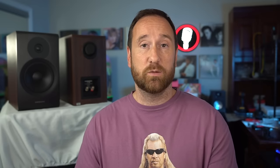I ran another impedance sweep on the woofer with the CLD applied. It didn't resolve the resonance, which means something else is going on — and I'm not going to destroy the woofer to find out exactly what. But I'm not making a mountain out of a molehill when I say that the resonance from the woofer imparts a sound characteristic in that 600 to 800 hertz region that I just didn't care for.